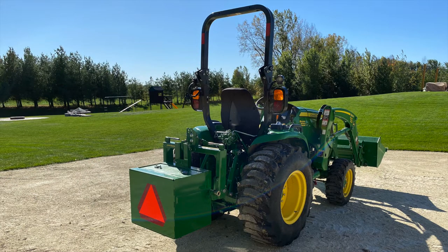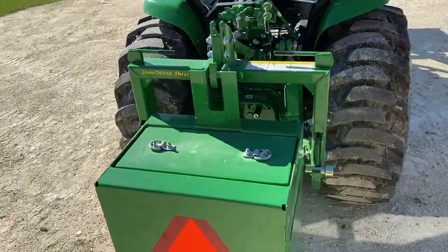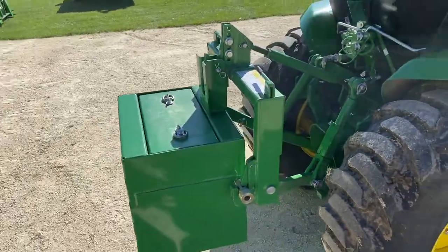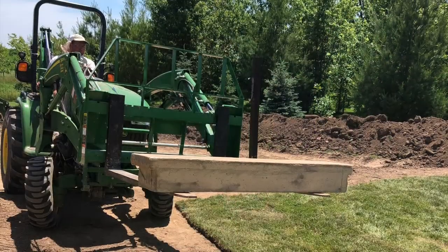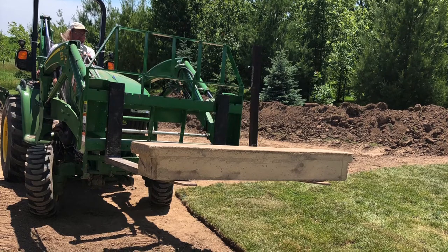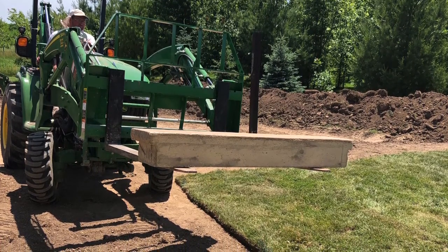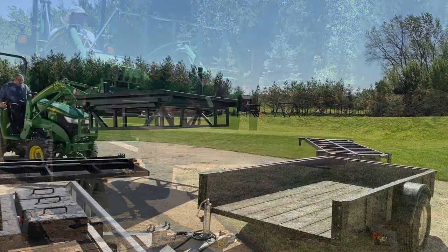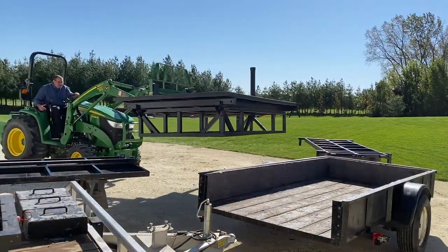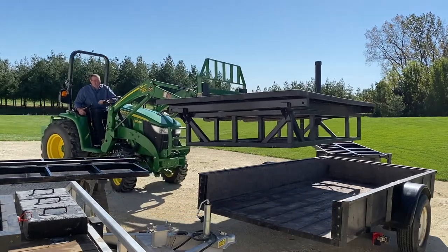The ballast box is going to come empty. You can put anything you want in there, and the general idea is it's just supposed to give you some counterbalancing weight near the back of the tractor. Sometimes you're doing simple projects with loaders and pallet forks, and other times the physics really puts you in some dangerous situations if you're not careful — maybe going down a hill, turning, making a sudden stop, or flirting with the limit of what that loader can lift.